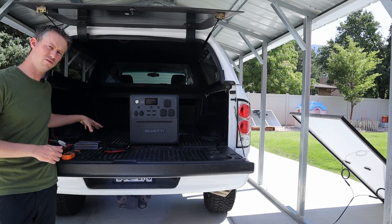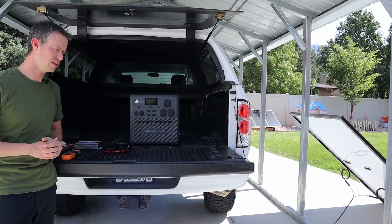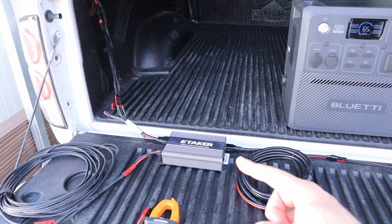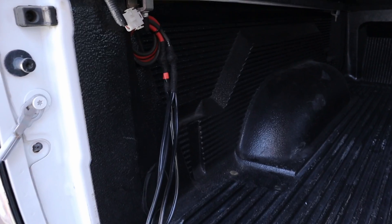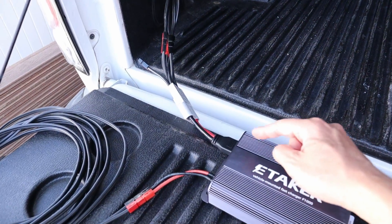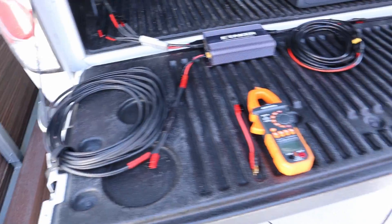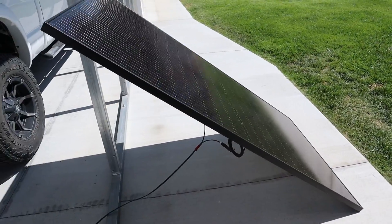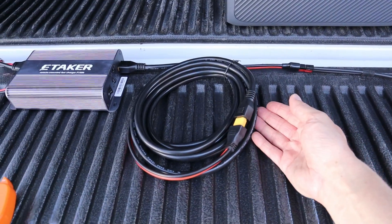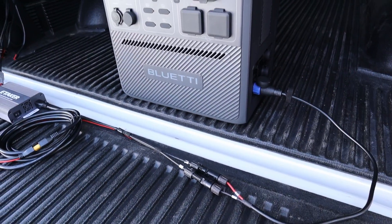Here I am outside. I have my truck connected up to the F1000 and also a 400-watt solar panel so we can test real-world results. For the car input, I wired a 6-AWG cable coming directly from the battery — that's the XT90 going in right here. For the solar charging input, I have a basic solar extension cable going to this 400-watt residential-class panel, which is angled properly at the sun. For the output of the F1000, I'm using the stock XT60 cable going to an XT60-to-MC4 adapter, and then the stock solar cable for the Bluetti AC240.